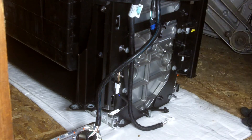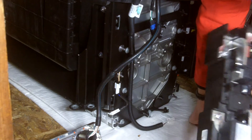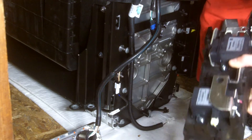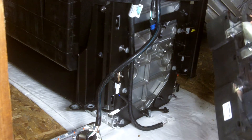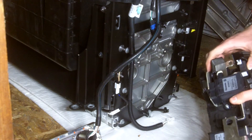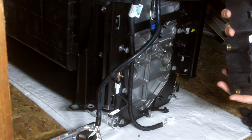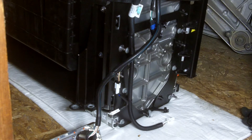If I had to guess, all the wires on these contactors... I see what they have here. They have a Hall Effect shunt in here as well — a three-wire Hall Effect shunt. It goes through a bus bar. The part number on that is NCVP300X, and that also has an AEV part number of AEV6501F.